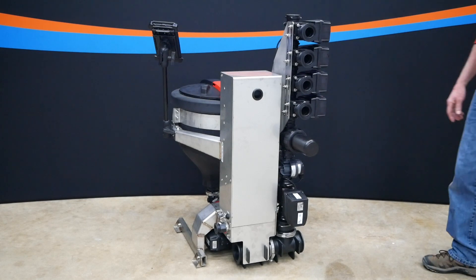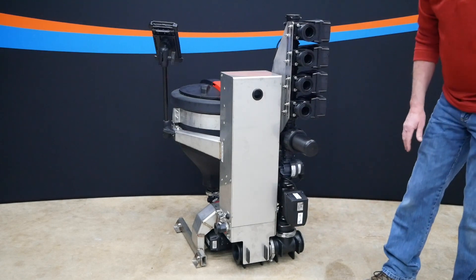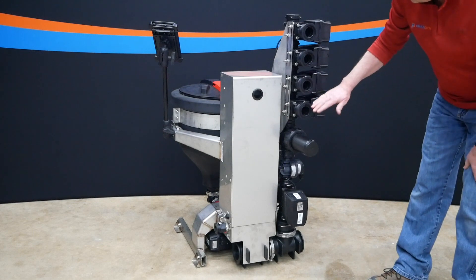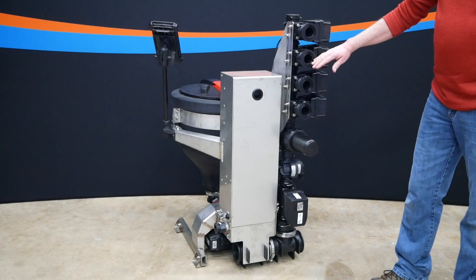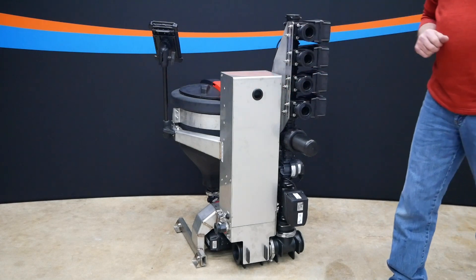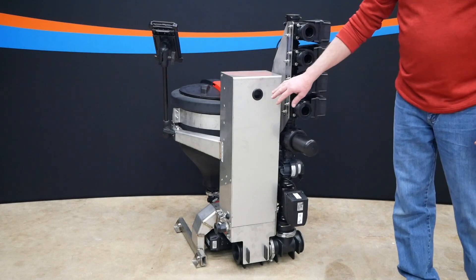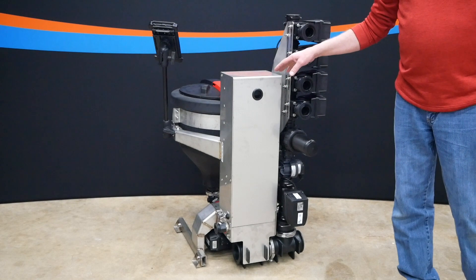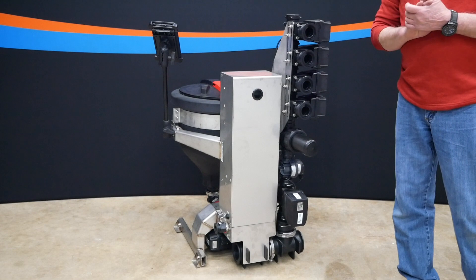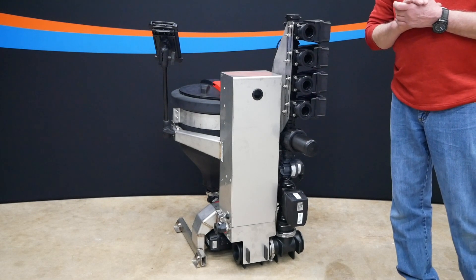Let's take a look at the back of the fusion inductor. At the bottom you can see the water manifold where the water travels through. We can see the connectors for the totes on each of the valves and the rinse water at the top valve. This hole is a finger hole to lift that lid off if you ever need to get inside the box — inside there are all of our electronics, protected from the weather and from sunlight.